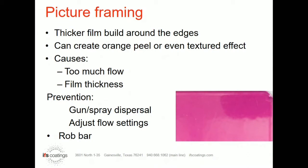So you get that heavy edge build. You run it through the oven and cure, and you see a difference in the look around the outside edges. Another time we see picture framing is if you have a product that has a lot of flow to it — if you have an area where you have holes punched in the part, once it cures it looks like the powder is wanting to move or almost sag around each of those holes or indentions. That's because of so much flow in the part. You get that little extra film build, and once it gets in the gel state it wants to move away from that edge. We all know we have edge pull with powder coat.